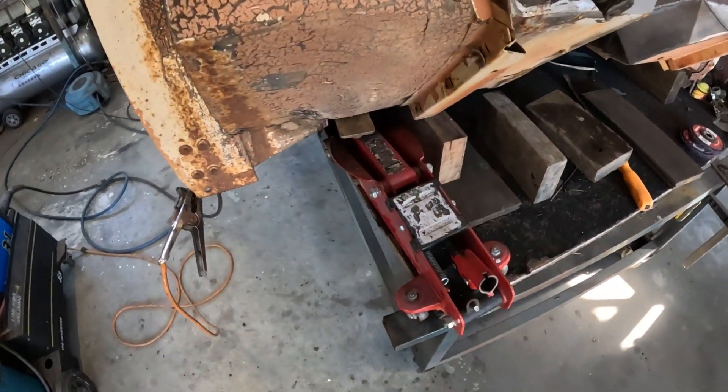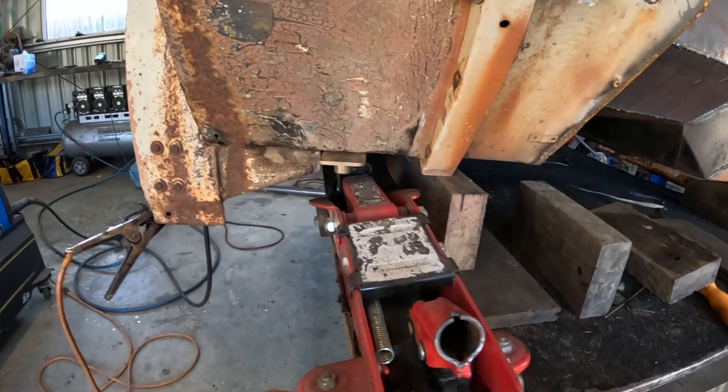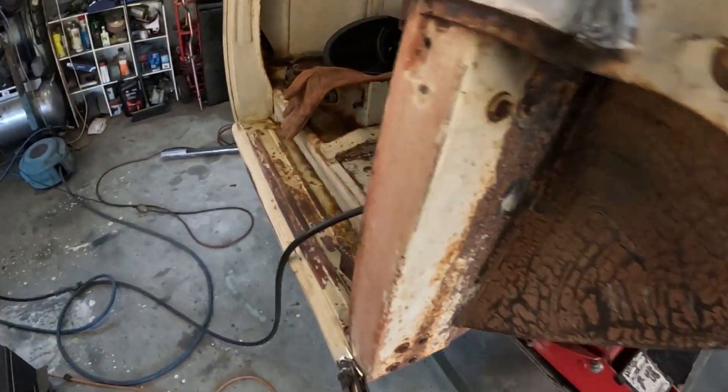I just went to use this piece of brass to do the job and realized my arms aren't quite long enough. So I jerry-rigged the jack up here for a second, holding that piece of brass up, got the welder set up and attacked these spots here. Could do that just with the welder, didn't need any backup behind it. So they're all taken care of — obviously got to clean it up, but going to attack these holes here as the test piece with the brass and see how we go.